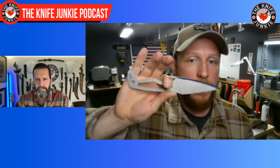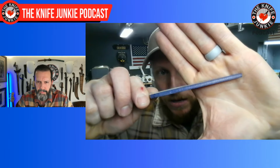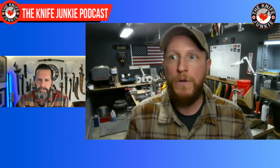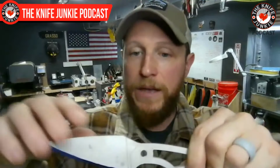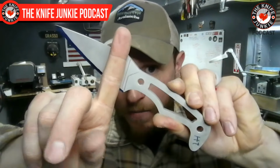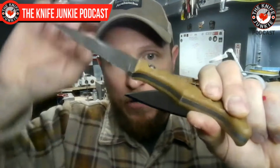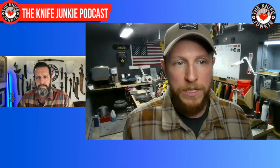And so you take that blank, heat treat it, and then it comes out, and I set all my grind lines on the blade, so I know where to grind to and you get some even grind lines. Aesthetics are super important to me. If you have a bunch of random lines that don't make sense, it's confusing. Like you noticed in the beginning, I designed this so that the tip lined up with the center line of the knife. When you put the scales on, I matched the pitch or angle of the bevel to the pitch of the scale. You can see these two are equal. It's a little hard maybe to tell in this picture, but they're equal. And I try to end it right where that point is in the scale. Everything ends up being super aesthetically pleasing. Even though they're simple things, the simple things add up and have a compound effect.